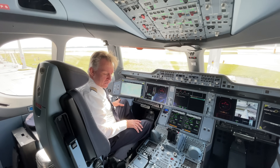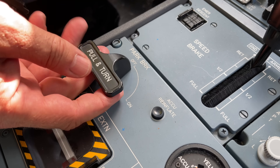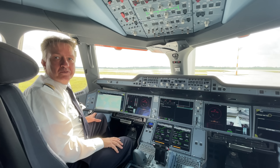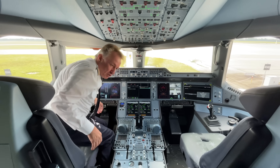First things to do is you have to prepare the aircraft for the walk around: set the parking brake to on, prepare the nav lights to be inspected whether or not they're working, and then let's get dressed for the outside check.